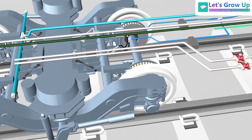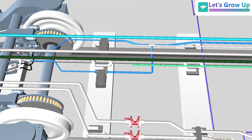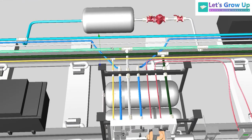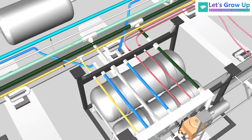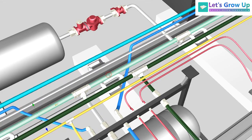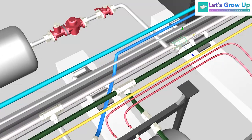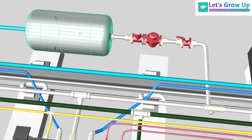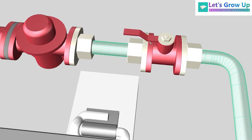This yellow pipe is coming from the 75-liter tank for the toilet system, going to both side bogeys. This output pipe is still under development, and the air suspension is also under development. This output pipe is for the toilet system. Next, this is the FP pipe, and through this FP pipe by a T-joint — as I already said — there is an input connection to the control panel, and through this FP pipe another input connection.